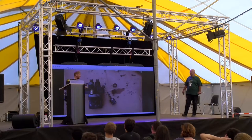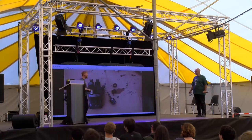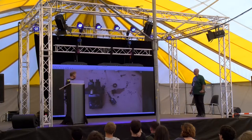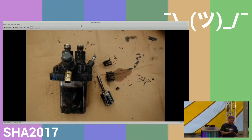The first hit on YouTube for the diagnostics was an Australian guy, who said, take the injection pump apart, you maybe got a broken spring. So I took it apart, had a broken spring, and because of that, the pump doesn't return, so the engine gets no fuel. And there's the broken spring again. But yes, if anyone wants to help me out tomorrow, maybe some telephone calls or local knowledge, we can track down where to get either an original spring or a suitable one, and I can go home under my own steam rather than on a wagon.